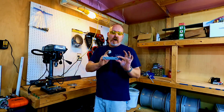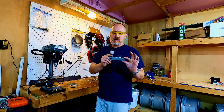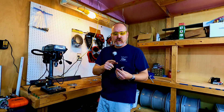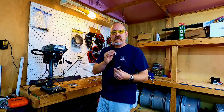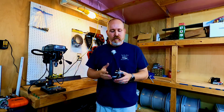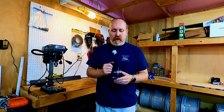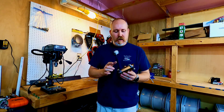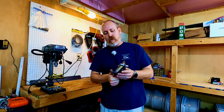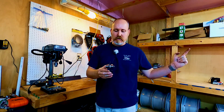The flat steel is cut. On one side I used the 25/64 drill bit and on the other side I used the half-inch drill bit, because we want to make sure we don't short the center pin conductor. Assembly is complete - I believe we have something that's going to work. I have the center pin isolated from the plate and from the bar. The outer shield is connected to the bar that will go to the other end of the dipole this way, and the center pin passes through isolated and goes this way.